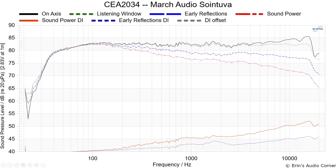Your only enemy is really just the mechanical throw of these woofers. The speaker gets down to about 40 Hz — I think the F3 is somewhere in the 50 Hz region, maybe a little lower. For most people in a room, you're going to be okay getting down to at least 50 Hz, maybe even 40 Hz. It covers the basic range of most music. But if you want really low output, you're definitely going to need a subwoofer. Then again, this is a bookshelf speaker, so that kind of goes without saying.